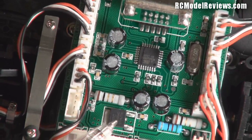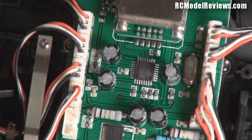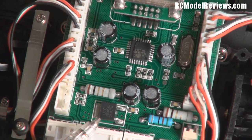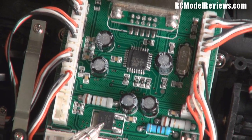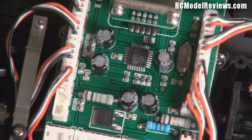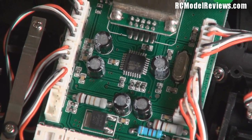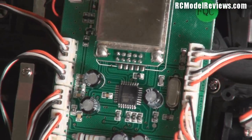I'm a bit disappointed to see that this is a linear regulator - there's no switch-mode regulator inside. So the full nine volts of the battery will mostly be wasted, because it's not being switched - the excess voltage is actually being dissipated as heat. The excess from the 9.6 volt battery pack - what a shame. They could have gotten away with using a four cell battery. I don't know why the Chinese manufacturer is still sticking with 9.6 volt packs in their transmitters.